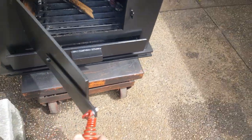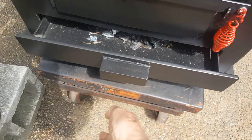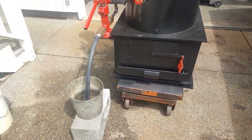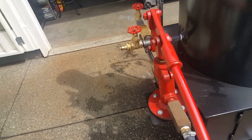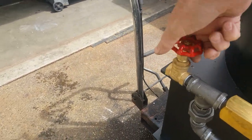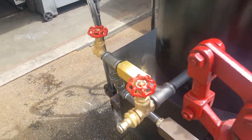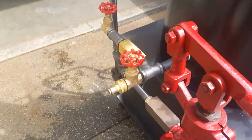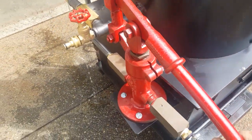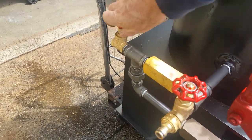This doesn't get hot at all. And the ash pan here — that does get hot, be careful with that. It's got a really good pump, one inch ram on it. Your air check valve is right here — if you've got air in the pump at all, just open that up, and once you've got water coming through, just close it off and all the air's out of it.